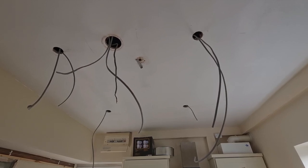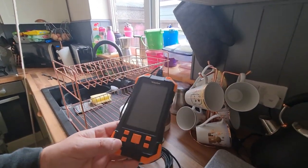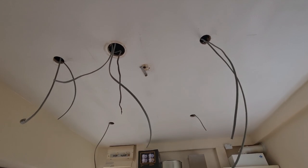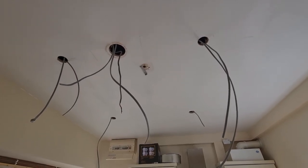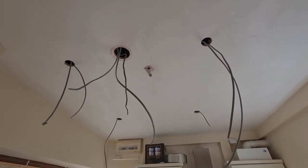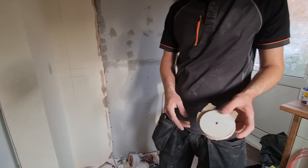After all of that, we've got one hole in the ceiling to install four spotlights, all from working below — you don't have to punch the ceiling with a million holes trying to drill joists. To help us a little bit we used one of these inspection cameras, so we can have a look up the hole and see what's there — mainly to check the other side of the joists for pipes or cables before you drill through. We were lucky in this case that there was actually a cable route already there and we just followed that same route, reused the existing holes to fish the cable through. Now we can get those in — 64mm holes for the spots — and then plug that once we've made the junction box with the four-inch bit we cut out.